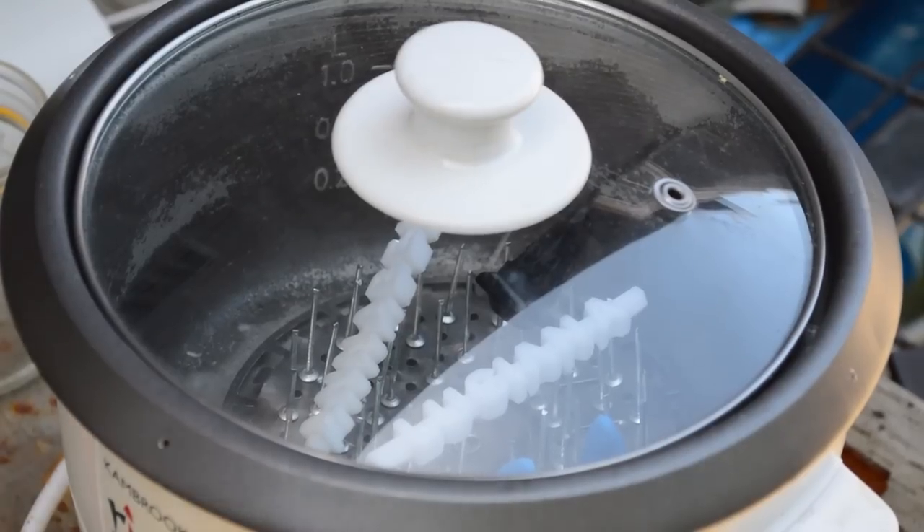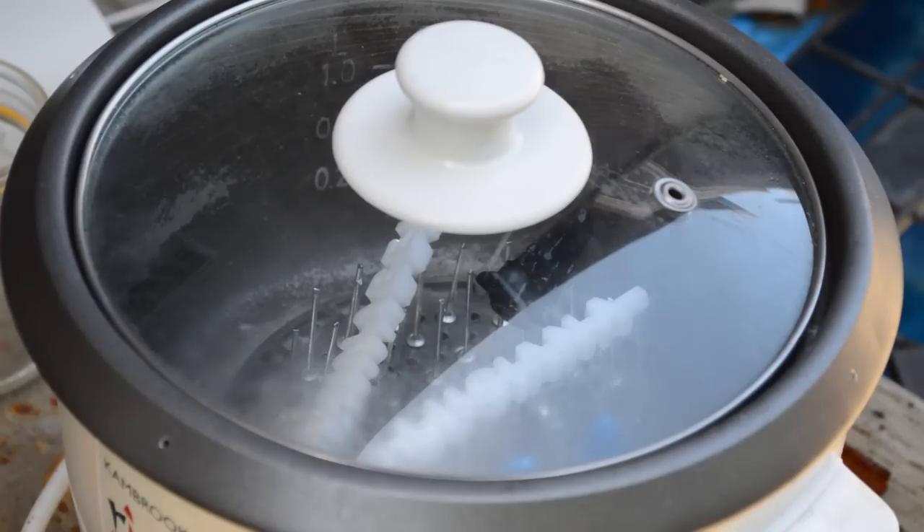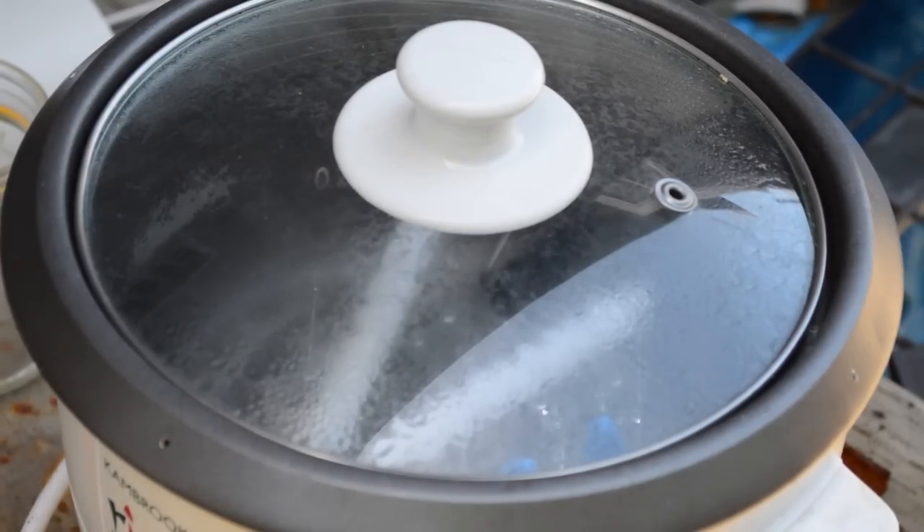You can see it actually starts to affect the parts now. It's pretty much reached about halfway up the chamber. Parts start to go glossy and shiny and you can see it's now starting to hit the top of the rice cooker. Once it starts to condense on the top, I usually count for about 30 to 40 seconds depending on how long you want to leave it. You don't want to leave it too long — if the parts get too hot, it'll start boiling off the surface and you'll get pit marks, which is awful.